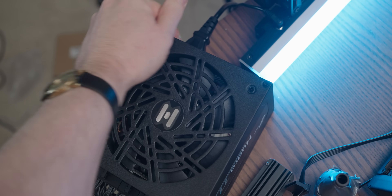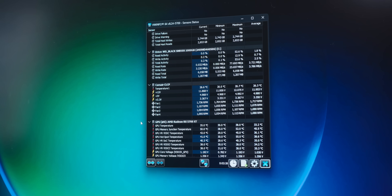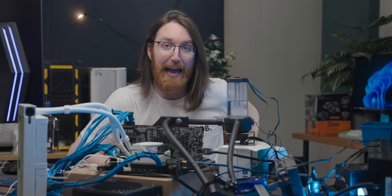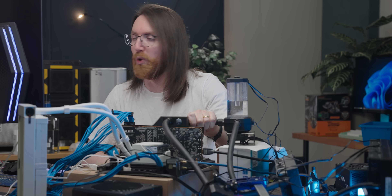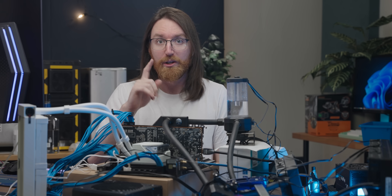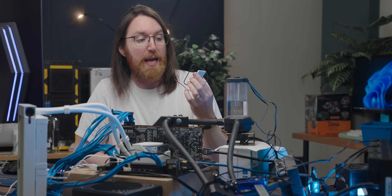While Cyberpunk is launching, we're looking at 26 degrees Celsius for our coolant. After flicking the Peltier on, the results weren't great — the loop temp was still climbing. I double-checked that the correct side of the Peltier was touching the water block, which it was; it just wasn't helping. Even with no load on the GPU, the loop temperature is barely cooling down. There's so much thermal inefficiency going on that it's just not doing anything.